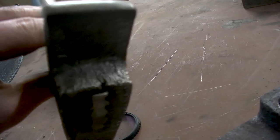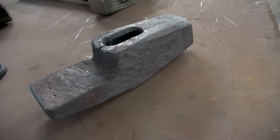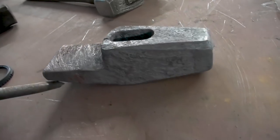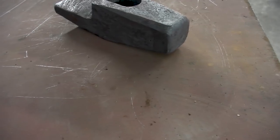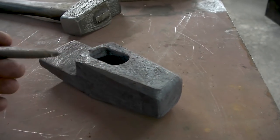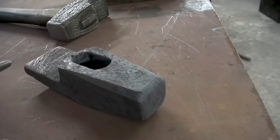This little hammer's got the same thing there. And I know that is not much of an issue. Of course, it would have been prettier if it weren't there, but here it is. The color on it is good, and I have heated it up and let it cool down slowly a couple of times and looked to see if I can see temperature differences, if the face or any other part seems to have a much darker spot or a much hotter spot. I didn't see that.